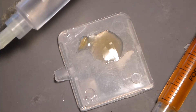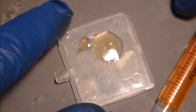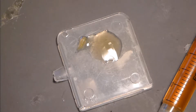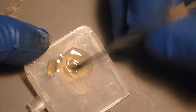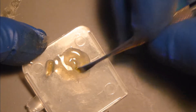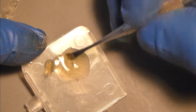We're going to use a dental tool rather than a needle to apply this. Air bubbles are not your friend — they result in porosity inside the epoxy. As it sets up, the bubbles will gas off creating little pockets of empty nothing, which will weaken the substrate. So this is your new substrate. Let's move our circuit board right here and put a very thin layer of this epoxy on our freshly prepped area. I cleaned this multiple times, also cleaned it with alcohol, then added heat from the hot air station to make sure it was good and dry.